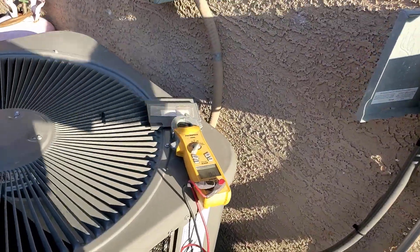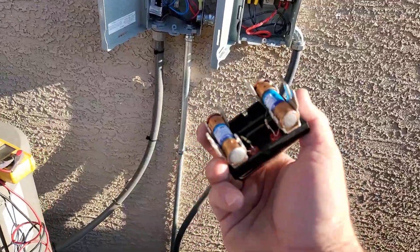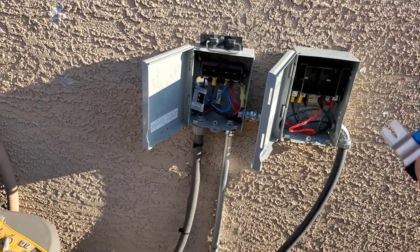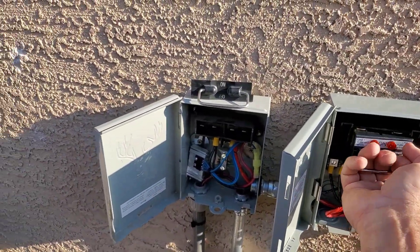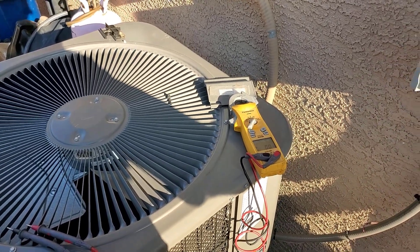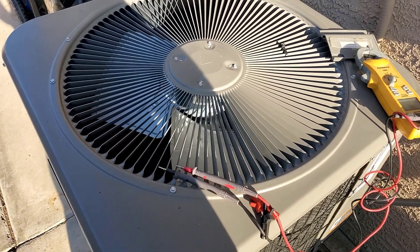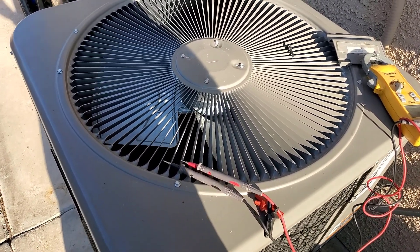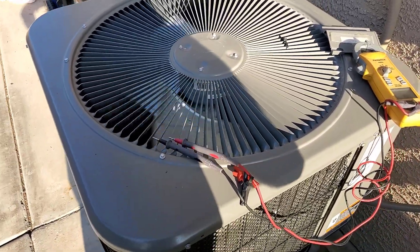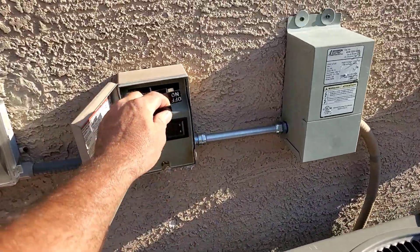So put the batteries on. We're missing a disconnect — here's the newest one. I put some fuses in there, I wanted these batteries fused. I'll probably put some inline fuses down on the batteries too when I do a permanent one, but this is better than nothing. Looks like up is on — let's watch this, see if it starts. Now that it's been off about 10-15 minutes, it might have latched to second stage, maybe at 60 Hz instead of 40. There it goes, it started! Fan motor looks a little pissed off. And it just shut off on current when the pressure got too high — these batteries are a little too low.